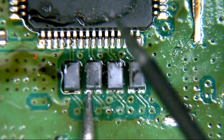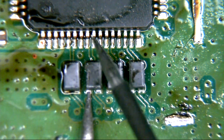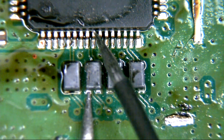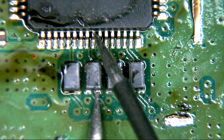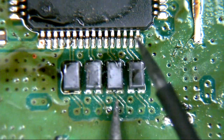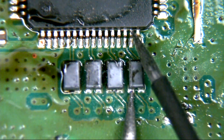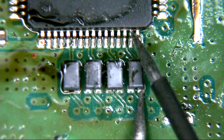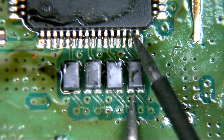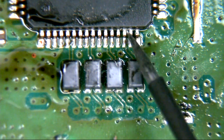Let's just have a look at what we're getting here. On the left hand side we are getting 1.8 ohms, which is near as damn it to zero. On the right hand side we're now getting open line. Moving to the right hand side, we're getting 1 ohm - perfect. On this right hand side, going to the left we read across, go to the right getting open line. To the right hand side reading continuity, 1.3 ohms and dropping. Back to the left and we should get open line, and we do. We don't get any reading at all - open line, which basically means there's absolutely no communication between these two pins, which is good.